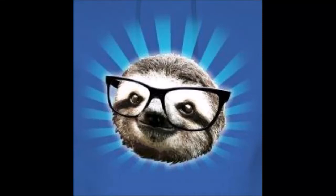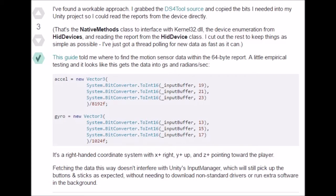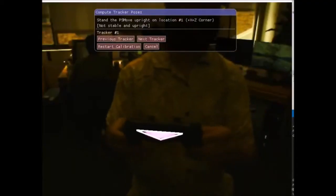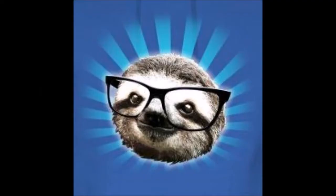So then the next step was to make a calibration tool for the gyroscope that would let me determine how much to scale the raw gyroscope values by. The website that I was looking at said I should divide by 1024 because that's what felt right. And I said, well, I can probably do better than that. I had been working on the optical tracking for the controller. I said, I know, I'm really smart.